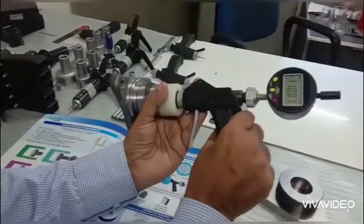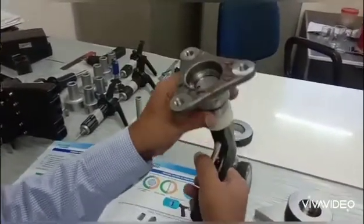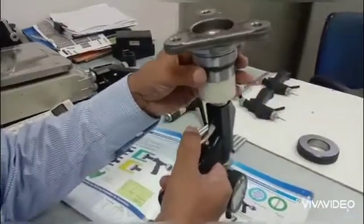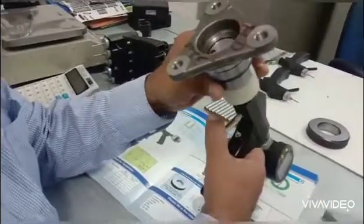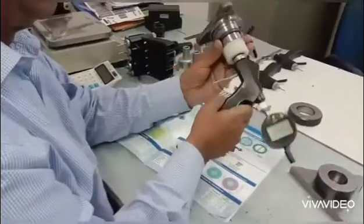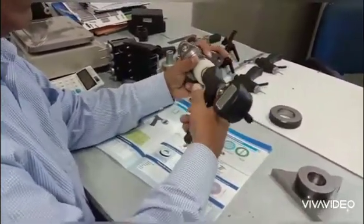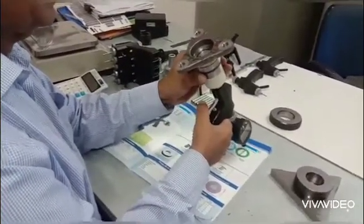With this system I can show you that this is giving us a reading of thirty-one point zero zero seven. The method of measurement is simply to locate it on the stop and let the gauge — or rather the component — find its own position. It can't go anywhere; it will measure by going onto the tooth it's designed to go onto.